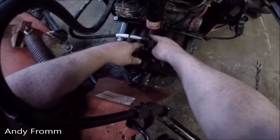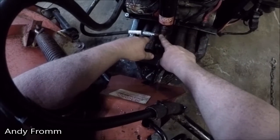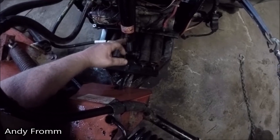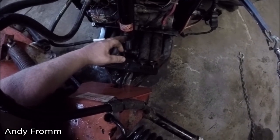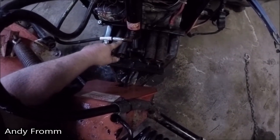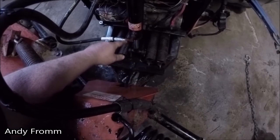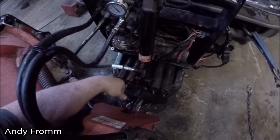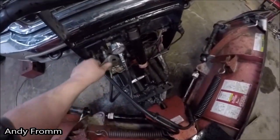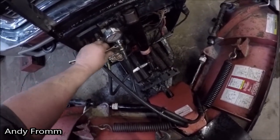See, this one is actually an O-ring boss. There's an O-ring behind a washer there, and this jam nut can turn so you can adjust this fitting. That's O-ringed in there. That does not need any sealant either. That's actually a straight thread, so you could thread a bolt in its place, basically. But these pipe threads are tapered. But on these swivels, they actually seal on the inside. And when I get my gauge back off here, I'll show you what I'm talking about. So here's that fitting I'm going to take apart for you. We're probably going to have some oil loss in here when I take this apart.